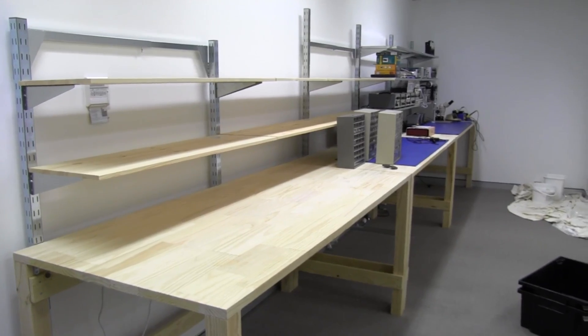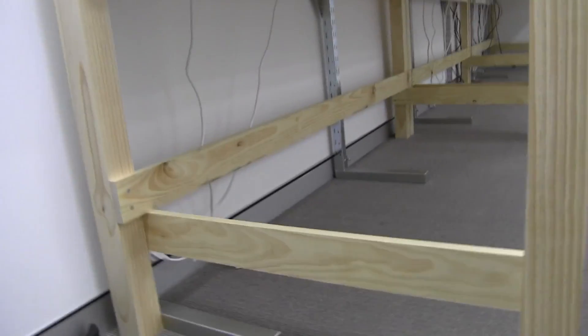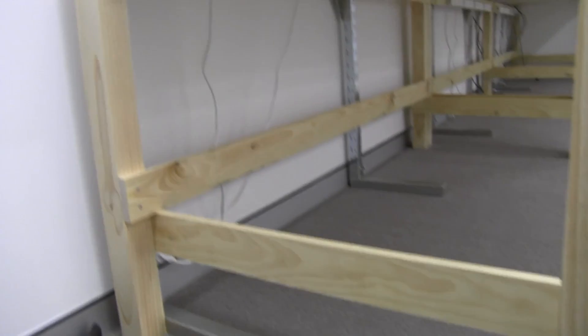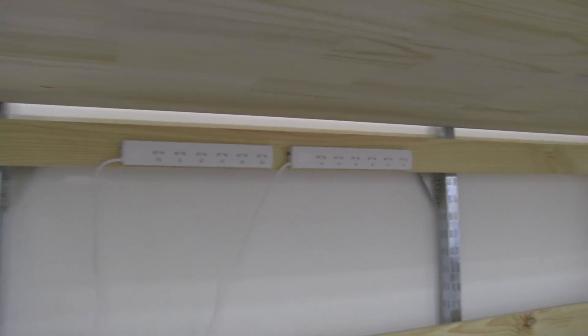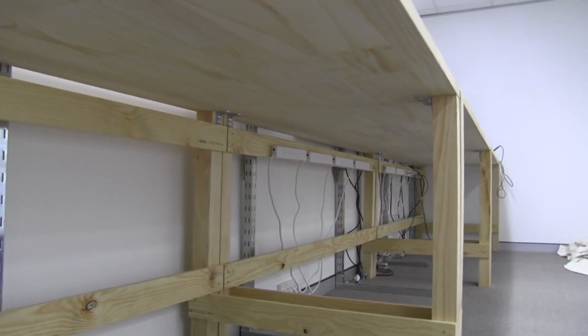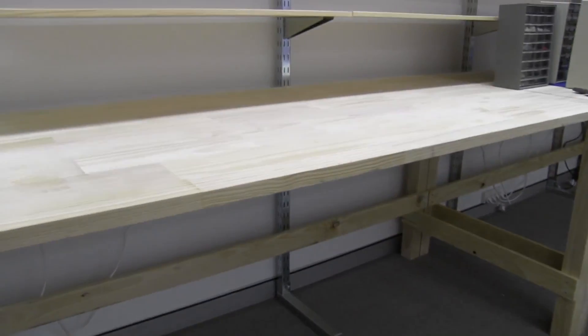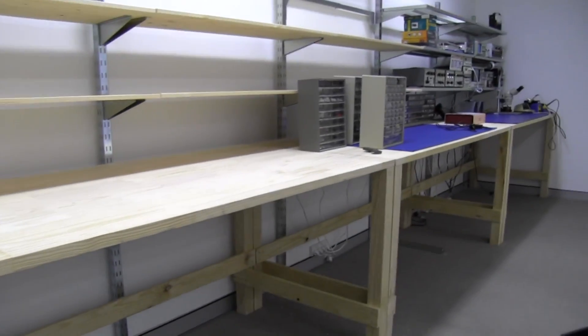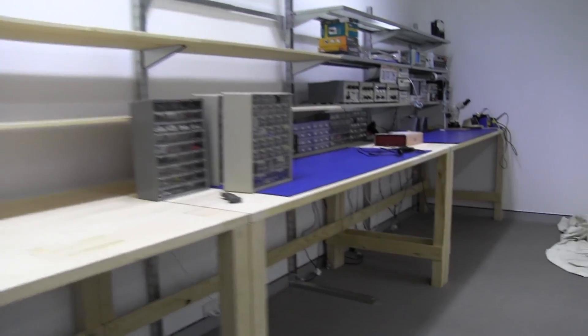Let's take a look at the bottom part. Underneath I've got cross-bracing pieces — pine as well, I think 70mm by 19mm or 13mm pine or something like that. I've got a top strip up there with the power boards. I've actually got a total of 60 — six-zero — power boards: 10 strips of 6 each. I figure that should just about do it. The posts are 920 millimetres high, which I've come to think is a pretty ideal height over the years. That doesn't include the thickness of the bench itself, so they're 950 millimetres total height.